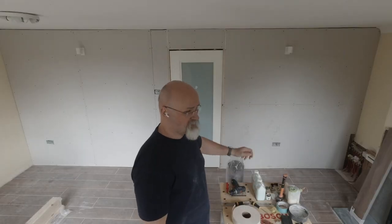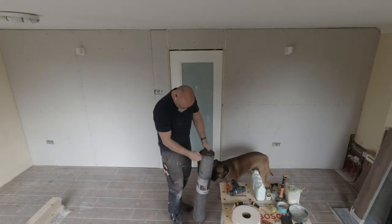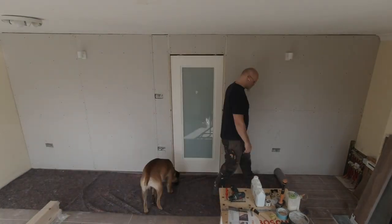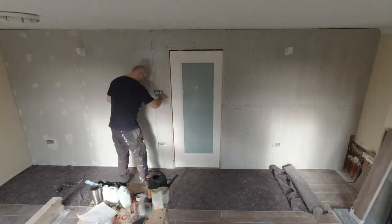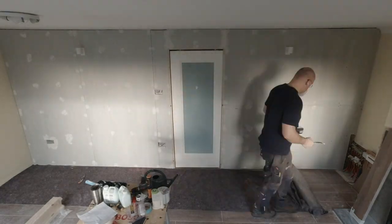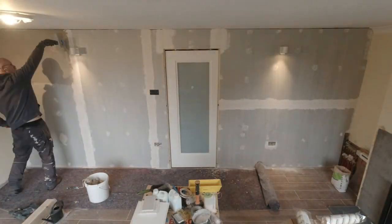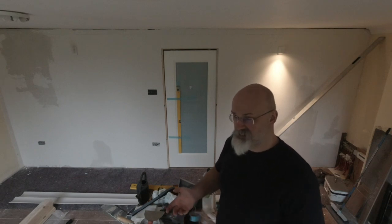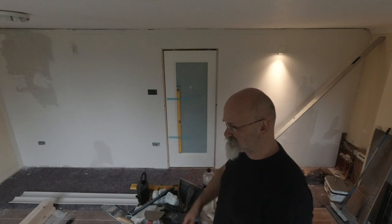I put the light on, tidy it up a bit, and now I'm going to prime. Why bother priming plasterboard? Because A, it decreases how much moisture of the paint or skim coat the drywall absorbs, and B, it increases its adhesiveness. The plan is to skim coat those walls. I have no idea how to skim coat, so I'll have to learn as I go. The camera storage was full, so I've completed plastering the rest of the wall off-camera. Still needs sanding.